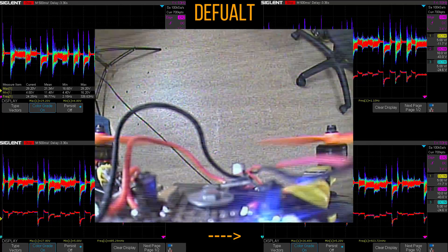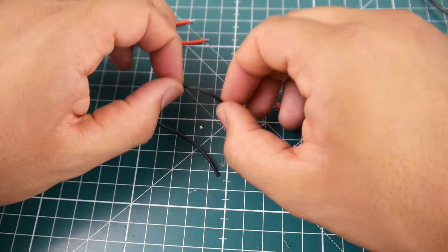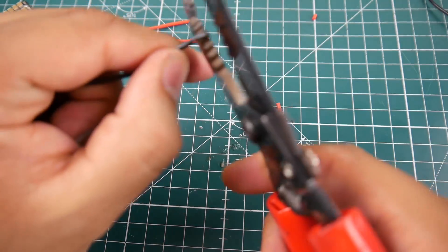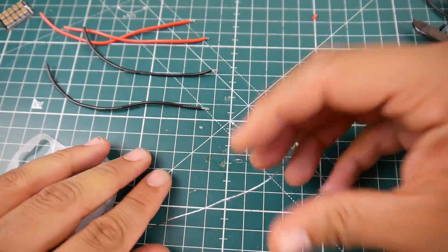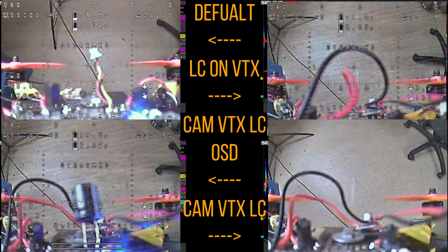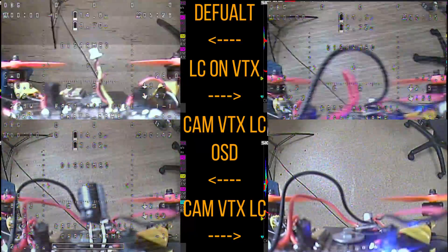I'm going to replace and test multiple cameras, since I have plenty here. The next step is to remove the camera, use my signal generator to simulate noise and control voltage, and simulate voltage sags - like when the motor goes to full throttle quickly and comes back down. If we see noise in the FPV camera with those simulations, then cameras are more susceptible. But it's not the camera's fault - the problem is we need to start avoiding LC filters. I'd also like to test whether this affects the gyro.